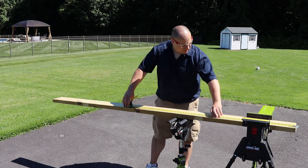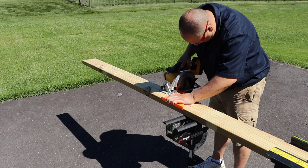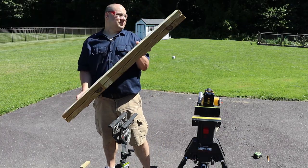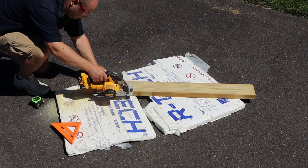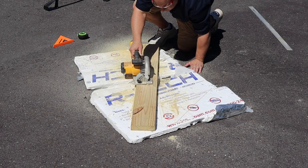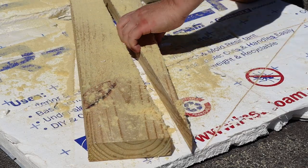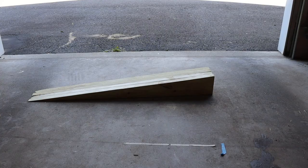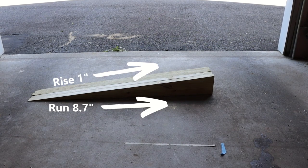Here's what I did. I took an 8-foot long 2x6 and measured it out 48 inches, then cut my 2x6 apart to create two identical 48-inch boards. I marked the line splitting those 2x6s diagonally and then carefully ripped each one with my circular saw. This gave me four equal wedges that I would use as my ramp stringers. These ramp stringers will go from ground level to 5.5 inches high over a 4-foot span.